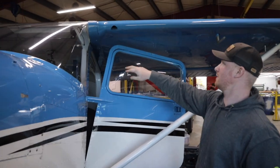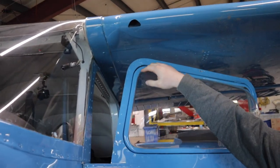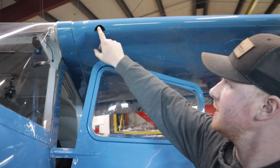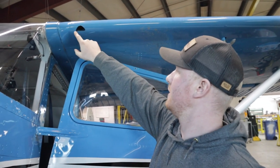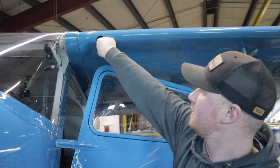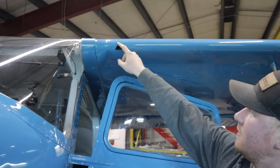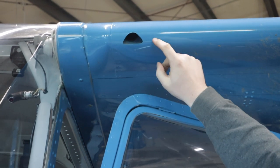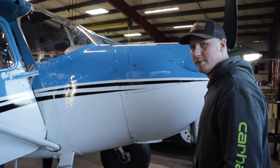These are upside down, which is kind of funny. Maybe they had the wing upside down when they put the STOL kit on and put that in right side up. This should be down and this should be up. The fix for that is I like to cut them rectangular and wider because you get more airflow. Everything here is correctable.